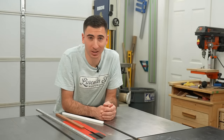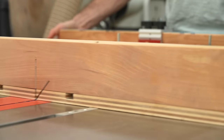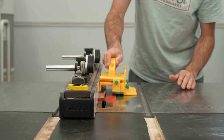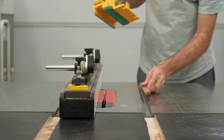While we're on the topic of crosscut sleds, let's do a little bonus item. I quickly mentioned runners when covering DIY sleds. Good runners with no slop will create the repeatable action of returning the sled to the exact same location relative to the blade over and over again — think of them like the foundation of your house. Building will cost you nothing other than an offcut you've likely been hoarding. To get the fit just right, slowly sneak up on the sides with your table saw, and the wood needs to be flat and straight.